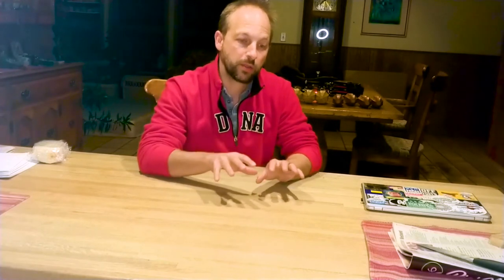The downside of not heating the beeswax up really hot is that as soon as we add it to the turpentine linseed oil, which is cold, the wax is going to re-solidify. So what we're going to have to do is get it in there right out of the oven. We'll take it into the garage and start pouring those into the tins. And I think we'll just fill them up to the 2 ounce mark. And that should be the right mixture with the linseed and turpentine we have in there.